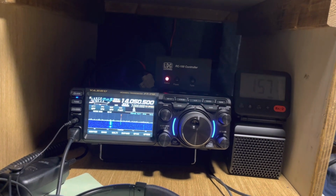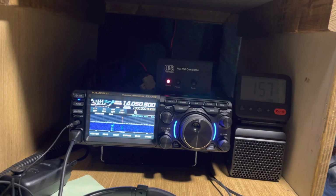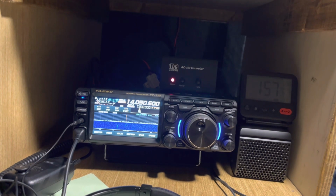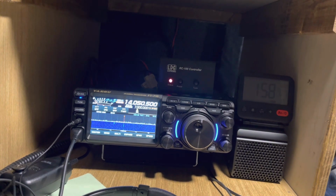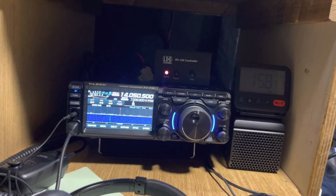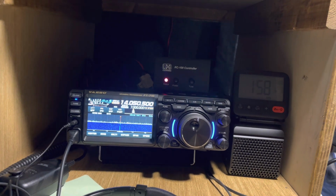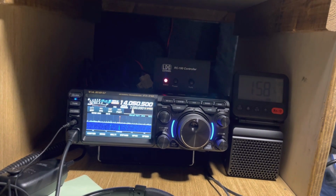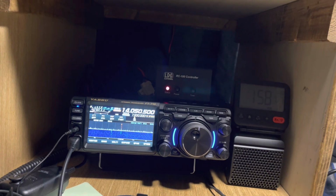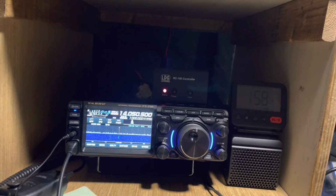In general, the radio works. It's a likable radio. The ergonomics on the ICOM 7300 is better. The receive quality, I still think they're really close to the same. I know Rob Sherwood says this is number 2. Yes, but he also says that for most applications, including contests, any radio that has a 2 kilohertz blocking above 90 for CW and above 80 for sideband is a good radio.